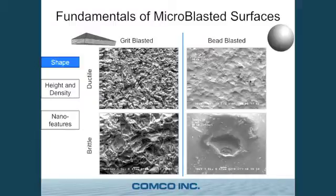When you start talking about brittle materials, they react to grit blasting much the same way ductile materials do, provided they're a homogeneous brittle material. If it's something like glass, it's going to respond very much like metal would. If it's something like a sintered carbide — where you have a bunch of small particles pressed together with or without a binder — then the fracture mechanics between those particles start to come into play. Bead blasting a brittle surface is essentially a lost cause; the abrasive will hit the surface and bounce off, and once there's enough energy, it compresses the layer and then the layer explodes out, leaving craters.